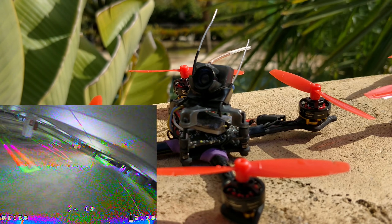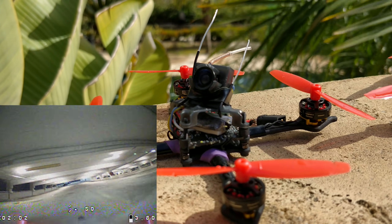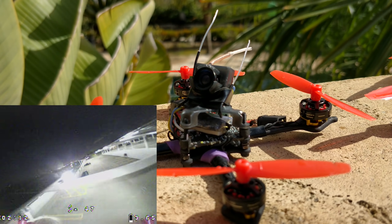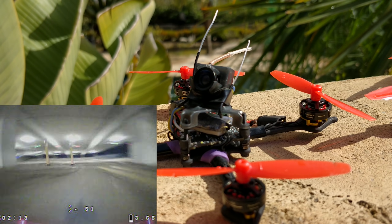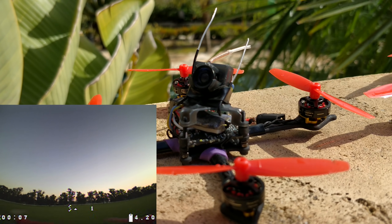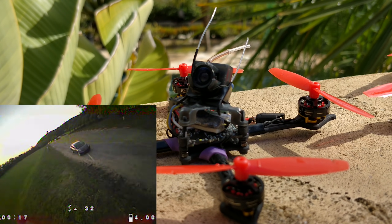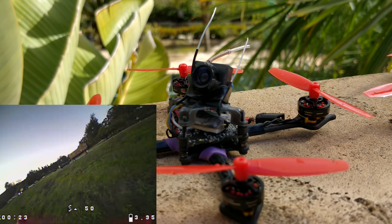However, I have a box full of brushless whoops and I have not found a single whoop that's a worthwhile direct transfer onto this frame. The 1103 builds with 2S are just so much more fun that I almost want to discontinue support for anything smaller than 1103, because the 1103 build is just so much better. Building one of these things only costs around $125-130 with the best parts, so it's very cost effective. The reason I want to talk about safety is that when you put 2S on this thing and push the all-up weight to 65-75 grams and it's really fast, safety comes into question.